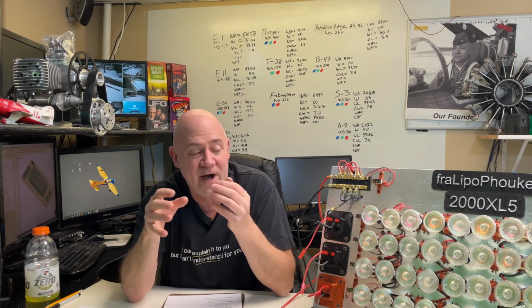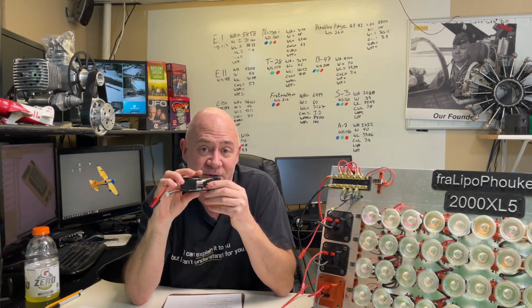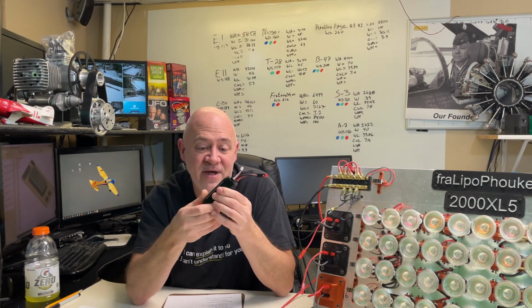So that's it, everybody. I hope you enjoy this video. I am going to do a video about designing and building this thing. I had something like this a couple of years ago that used some 12-volt car lights. These are all patch bays where I can patch my different loads and different watts. I can go up to 2,000 watts on this, and I can go up to 36 volts. And if you take a 2200 3-cell, which at its true 25C is about 70 or 80 amps, and you throw 150 amps on this, you'll realize why batteries swell.